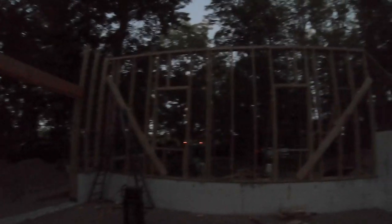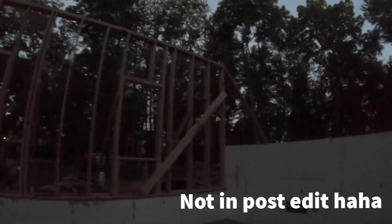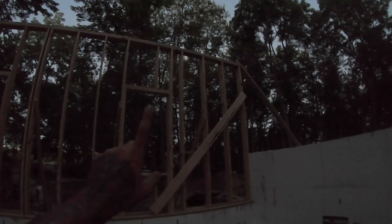Another day coming to a close - we got the front of the garage all done, though I don't think it's 100%. There's still some tilting in and out. I'm thinking I might ask Brian to let me rent some of those ICF braces again so we can push and pull this wall straight before I put on the sheathing. Good news is the garage foam and the basement foam have shown up - I've got to go pick it up tomorrow. So we can actually pause on this framing project and start on the concrete in the basement - order the rest of the sand, put in all the foam, the PEX tubing, and the vapor barrier down. We should be good in the next couple days to pour concrete.